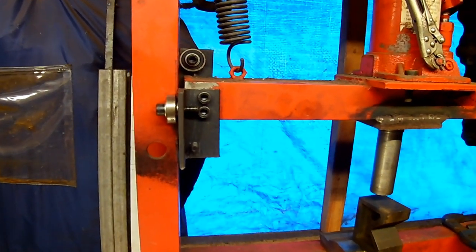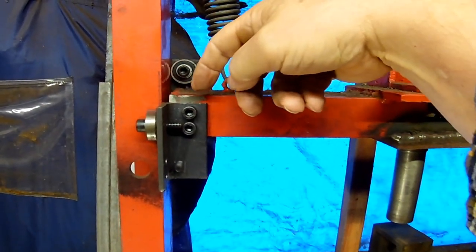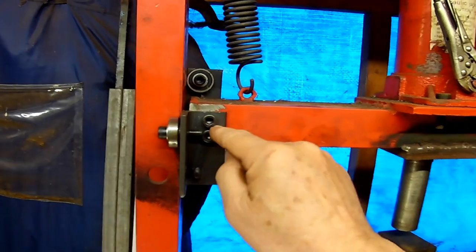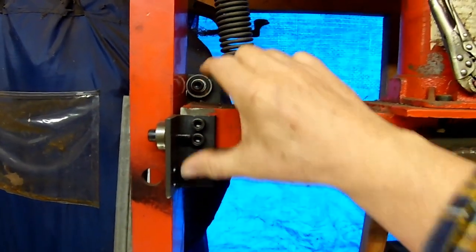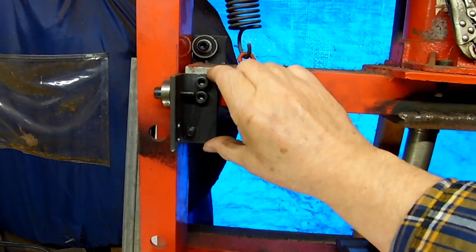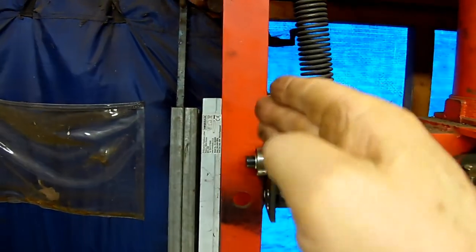So I had just bought my milling machine, so I thought, oh, I'll do a bit of drilling and tapping. So I cut the metal things off, and filed it flush, ground it flush. Drilled and tapped two holes in the thing there, two on each end. And made these little angle iron brackets. And on each angle iron bracket are two ball bearings. One that runs on there and one that runs on there.